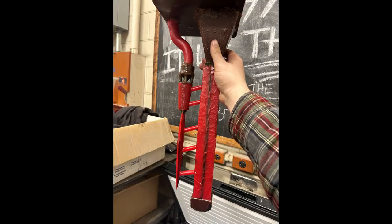From there, we moved into the wax room, where we're able to fit the gating system and the venting system to the 3D print. All of the wax here is cored to prevent cracking of the ceramic shell due to expansion when it's put into the burnout furnace.